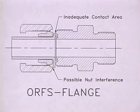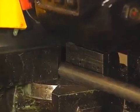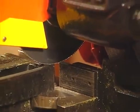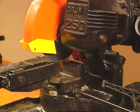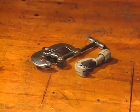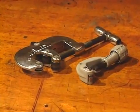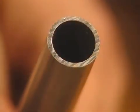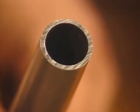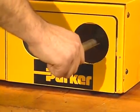Failure to cut squarely also results in flanges or flares that aren't circular. Whether you're cutting a tube end for brazing, flanging, flaring, or presetting, always use a toothed blade saw like a hacksaw or low-speed circular saw. Other methods like tube cutters or abrasive saws can cause the tube end to harden, making it difficult to flare or preset the tube. After cutting the tube end, you must deburr the inside and outside diameters. This makes sure the tube fits properly and without imperfections that can cause leaks.